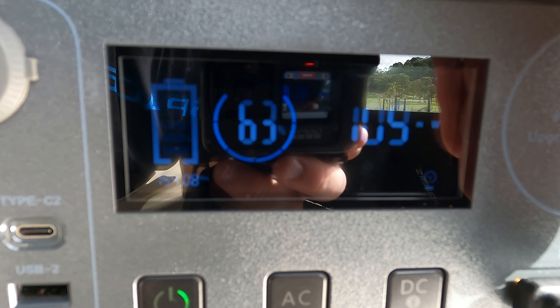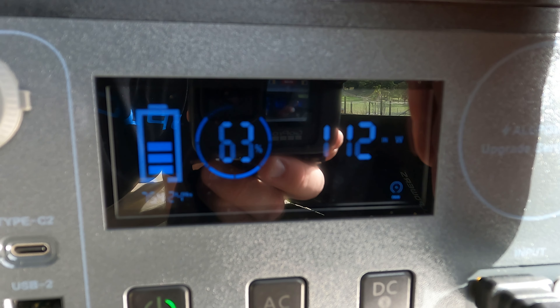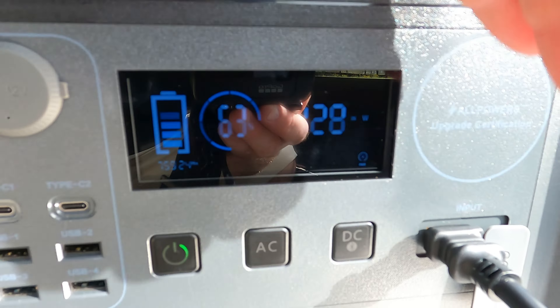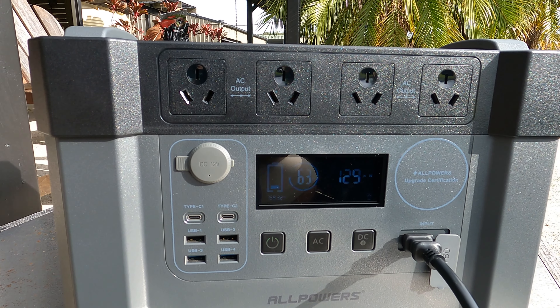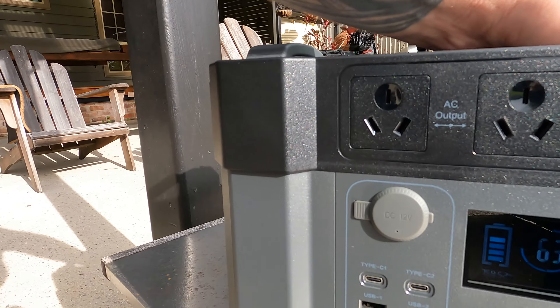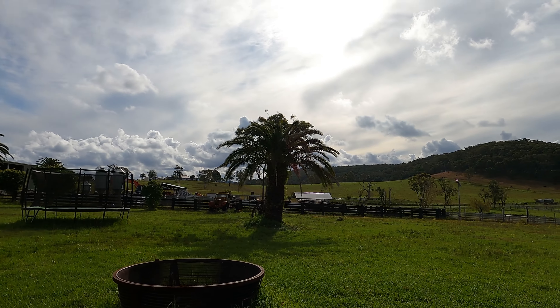I think the fit and finish of the panels — there are definitely some nicer panels on the market. Other brands have panels with newer technology on the face, and I think these panels are a bit dated, to be 100% honest. As the sun came out more from behind the clouds, we cranked up to 110, 111, 112, then 128, and up to 131 watts. It's up there with one of the noisiest on the market when charging, but these are priced cheaper than most other options. If you can deal with a few of these little things, absolutely go for it.